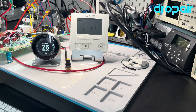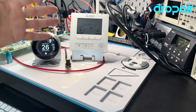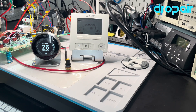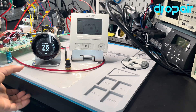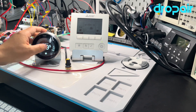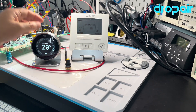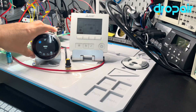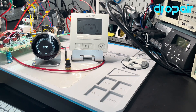That is to say, when the Nest runs from cool mode to fan mode, the original Mitsubishi thermostat will keep the cooling mode after it reaches the set point. But if you want to run the true fan mode — just without the cool mode — you will still have the fan mode function. If you do not need to cool down the room and just want to run the fan, you can use the eco mode, so the compressor will not run, only the indoor fan.